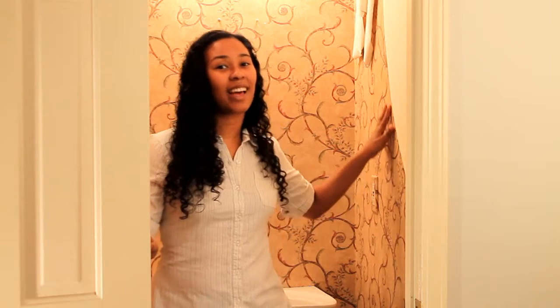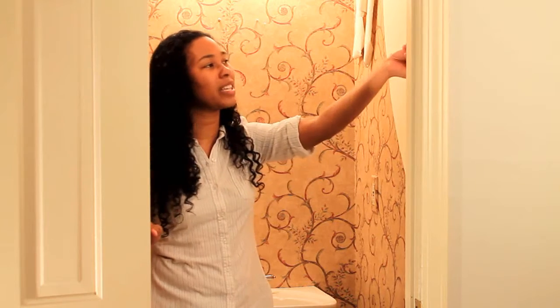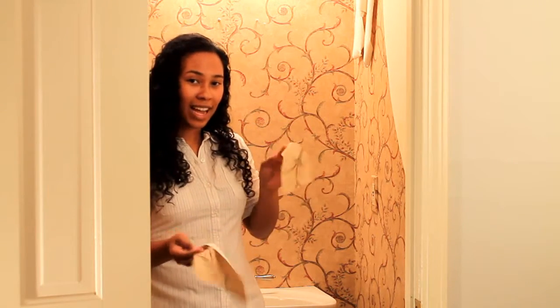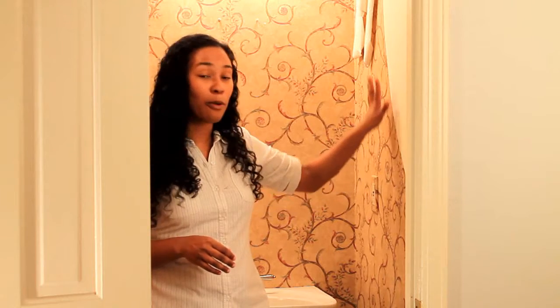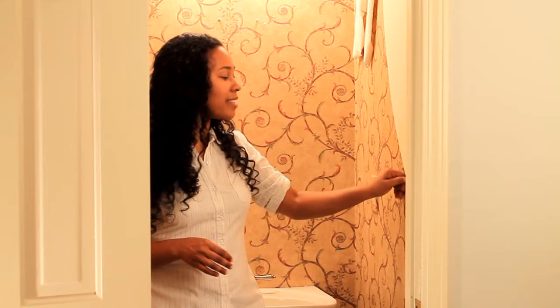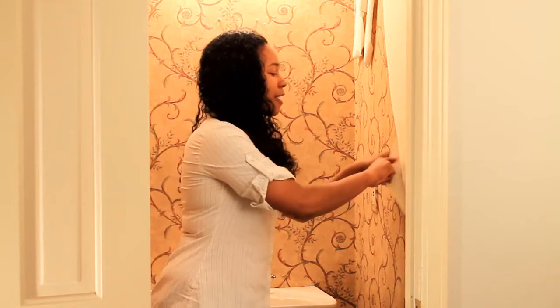Because my mudding wasn't very good, I ended up having to replace areas where there were patches in the drywall. So if your wallpaper is newer like this and has that plasticky finish on top — especially as you peel it back — then you'll know this is the ideal kind of wallpaper to remove. To get started, all we're really going to do is begin by removing that top plastic layer, so go ahead and give that a go so you can get your fingers under there.